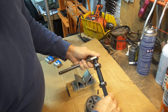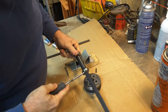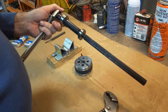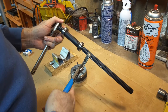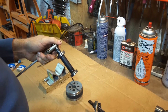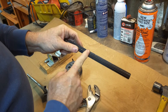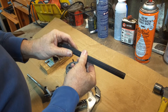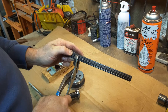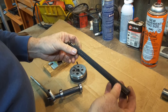I'm getting a little bit of movement, so now I can use a screwdriver to help pry it apart. This one fought me, so I had to use channel lock pliers to help me twist it to get it apart — a burr was on this one that made it harder to turn. When you're using the channel lock pliers, you have to stay above the area that your drive ring slides on. You can see right there, that's the line. It's okay to scar it up here, but you need to let the drive ring slide over that part of the quill.